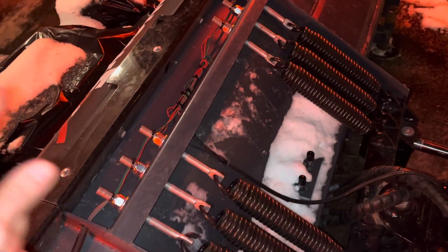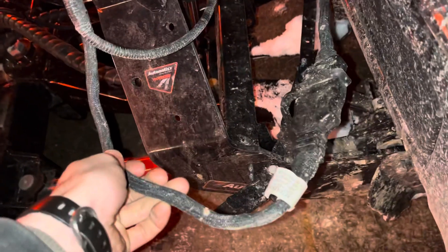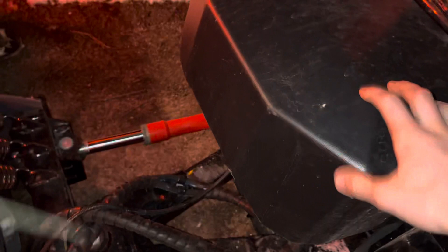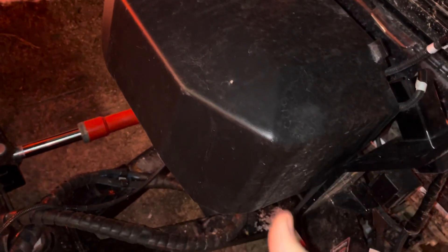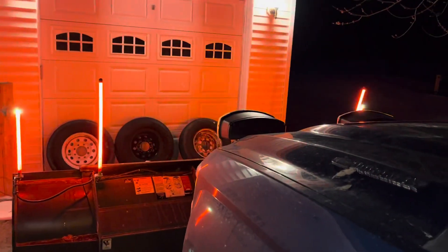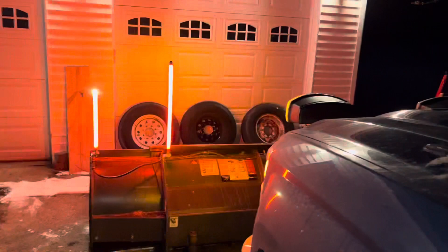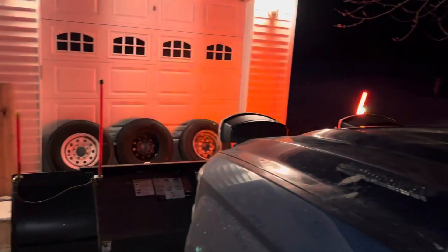When I get to the middle of the plow I spliced them together and ran them back. I spliced into the factory headlight connector, and underneath the hood near the hydraulics I have one fuse and three relays. I made my markers function as running light, turn signal switchbacks.